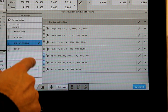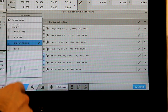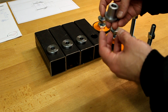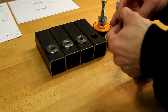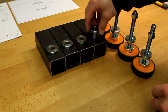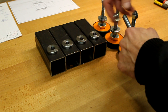Drilling — spot drill, then a 13mm drill, and just cut off with a chamfer on the end there. So we got our little bushing machined. Didn't get any video of it because the machine window was full of coolant so you couldn't see anything anyway. A little clearance groove there to get it all the way up. We'll fix it on that.